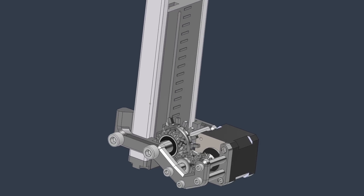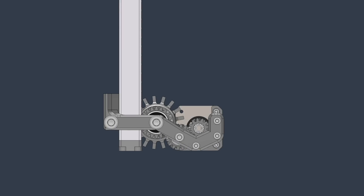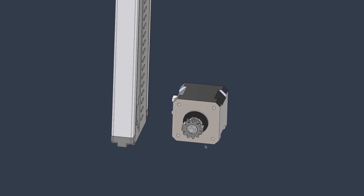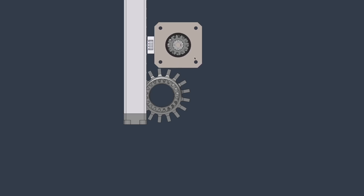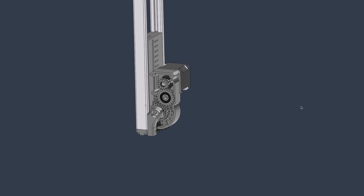So this is the old design. First we need to think about whether we want to keep this specific motor. The stepper motor is the widest part of the assembly and therefore it dictates its minimum dimensions. This NEMA 17 motor type is quite popular mainly due to its use in 3D printers and it's therefore quite cheap. Since we want to keep the sprocket as low in the magazine as possible to improve filling capacity and response time, there's really only one logical position left for the motor, and the rest of the housing design is pretty straightforward.